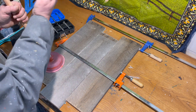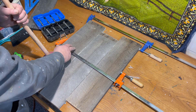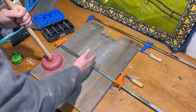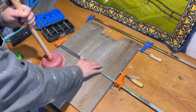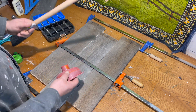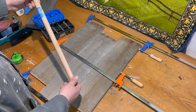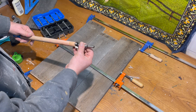With these boards, if you torque it down too tight you're going to end up popping the boards up and bending them, but if you put it on too loose the glue isn't going to have a chance to adhere. These sides aren't planed so they're not perfectly smooth — they may not marry up very tight. So I'm going to use this toilet plunger technique because I wanted doweling, and buying doweling is expensive. I just got this from the dollar store and I'm going to match it up with the diameter of one of my bits.